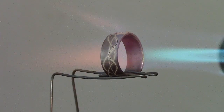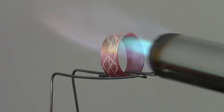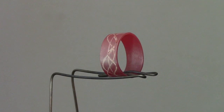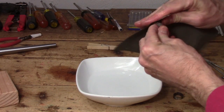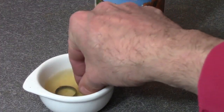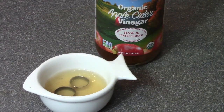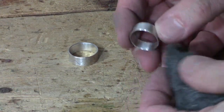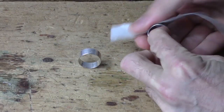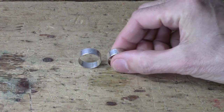And now the same thing for the second one. This black oxide comes off easily, but I'm pickling them in vinegar for a few minutes. The acetic acid helps remove the flux — and it's organic, so it's healthy. Now clean them up with very fine sandpaper and steel wool, and then polish them with paper of progressively finer grits all the way down to one micron.